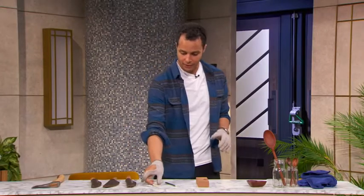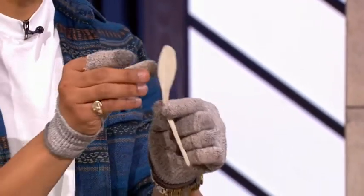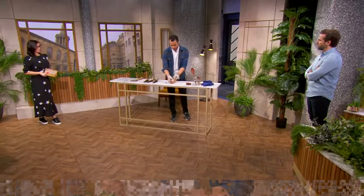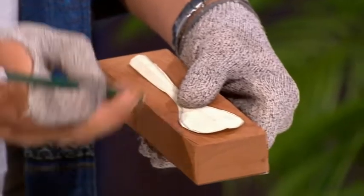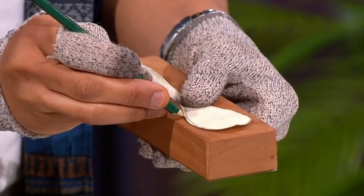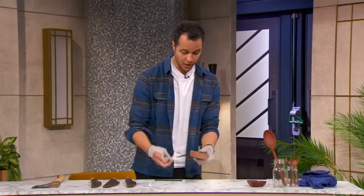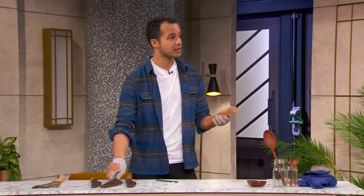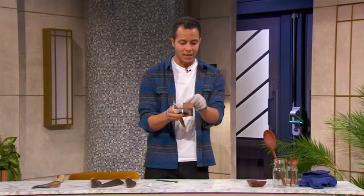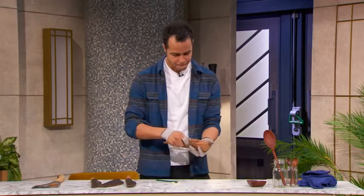Right, so I've already cut out a little template of a spoon. I've roughly drawn out the shape of a spoon, folded the paper in half, then got a nice symmetrical outline. What you want to do is transfer that onto the piece of wood — draw around the outside like a stencil. Once you've got your shape, the first thing you want to do is start carving out the inside. You could cut out the outside edge first, but when it comes to scooping out the inside, with the handle being so thin there's more of a risk of it breaking, so I tend to do all the inside scooping work first. That's a good tip.